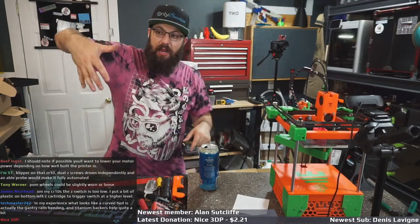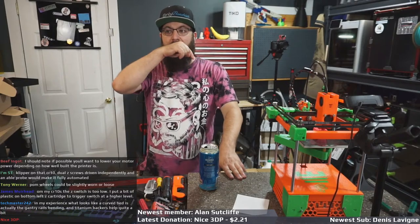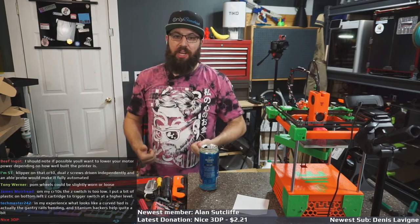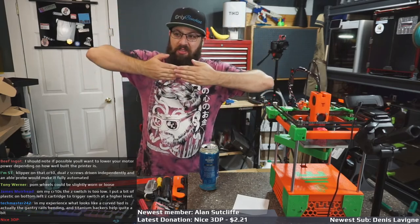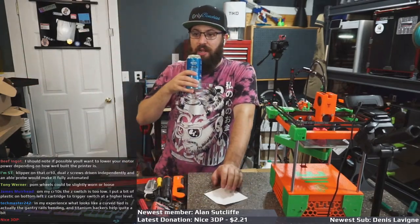So, it was funny, my Mark III, I moved it back inside because it was out here for a bit. And I grabbed it by the gantry, and I moved it manually. So I go back downstairs, and I go to do a print with it, and it does its bed probe, and it goes, hey, this is effed. So what it does is it goes to the middle, it drives up to the top, it re-squares the gantry, then it comes back down and does a probe again. It's like, okay, now I'm good, because I accidentally moved the gantry out of skew, and it detected that.